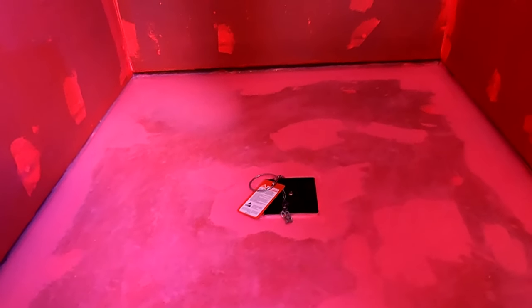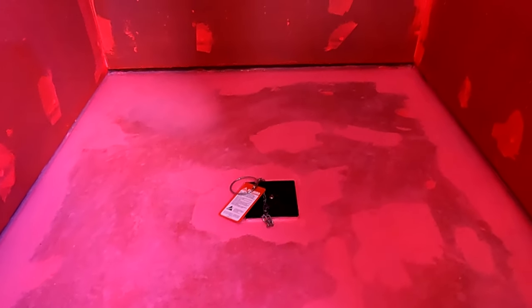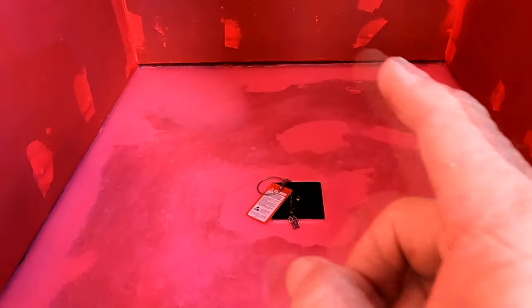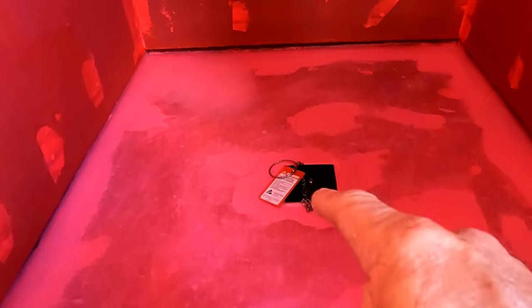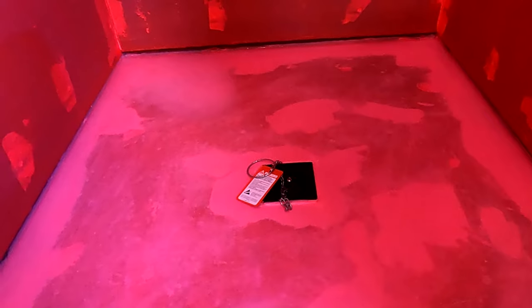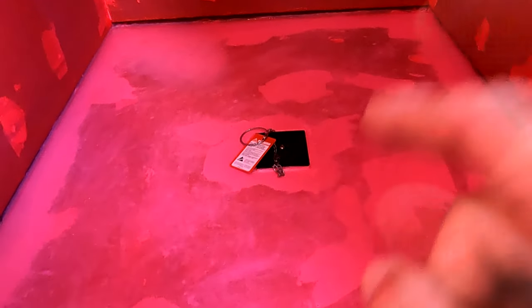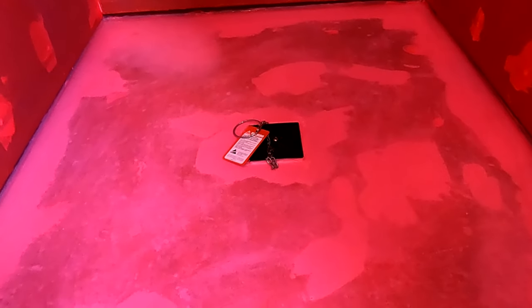When I started doing this seven or eight years ago — and if you go back on my videos, I have about a 13-year history on YouTube — you'll see I was only waterproofing maybe the perimeter, about five or six inches, because I always saw mold and mildew emanate through the grout line at the perimeter. I wanted to eliminate that possibility. Going forward I thought it's probably a better idea not to have water get into the pan at all — not to have the mortar saturated with water. That way there will never be an issue.